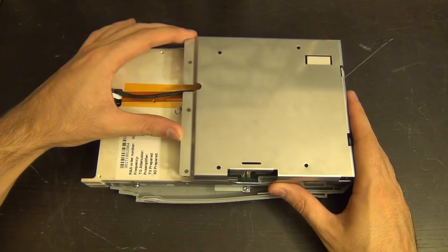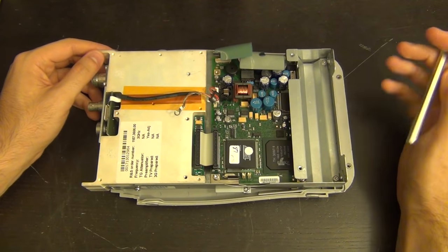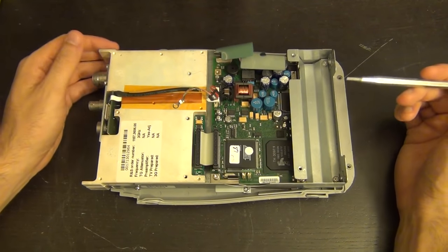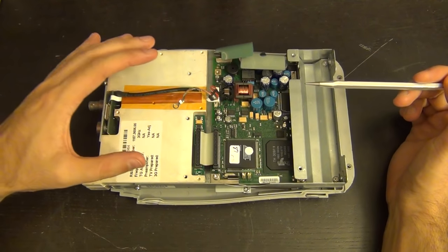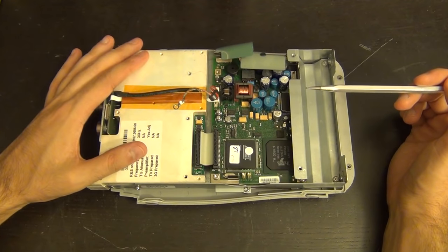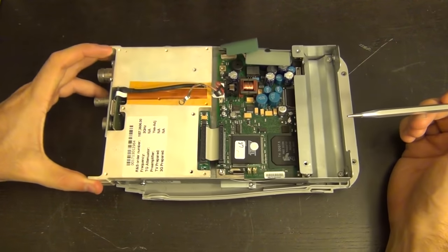If I remove that, the board itself looks fairly clean and doesn't appear to have any obvious physical damage. This cable is clearly the power cable coming from the front. The board construction is as expected - a complete two-board design. You have all the digital processor on one side and all the RF and microwave components on the other: the superheterodyne downconverter, mixers, PLL, and the multiple PLL domains, all enclosed in this chassis here.